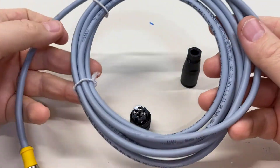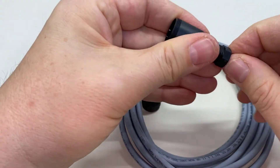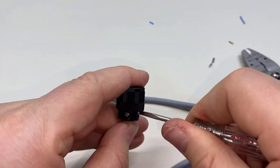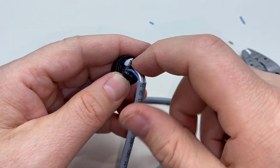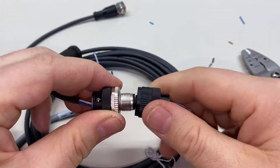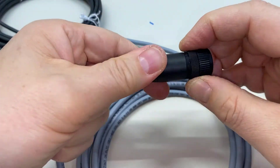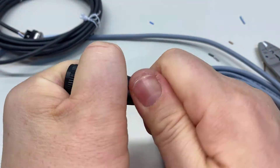So here on cable 124300, which has the male end, I'm going to do this quickly because it's the same process — push this through the gland and wire it up. Our female connector has white on number two, and from number one going counterclockwise it's brown, white, blue, black. It's a mirror image of the male one, so that when you connect them those colors line up. Now we can slide this barrel down, snug it up, and tighten the compression nut.